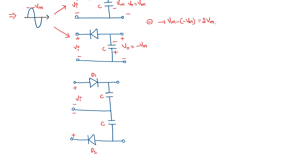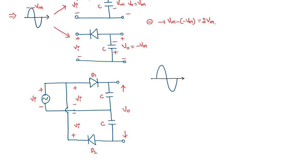In the combined circuit, one capacitor holds Vm and the other holds negative Vm. By connecting the inputs so there is only one input and taking the output across the two capacitor terminals V0, instead of subtracting the minus value we effectively add by flipping the capacitor. Now looking at the circuit's operation: during the positive half-cycle, D1 is on and D2 is off.